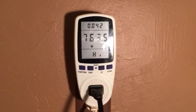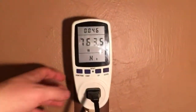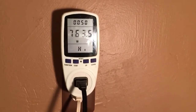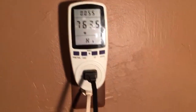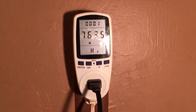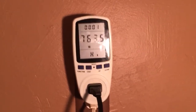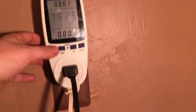Our low is 360 watts and our high is 763. The high and low wattage feature is really useful — say you plug in your fridge, you could have this meter plugged in and it will tell you the wattage that peaks. Refrigerators have high startup watts and then run a little lower, so it's good to know exactly what watts you need to start it.